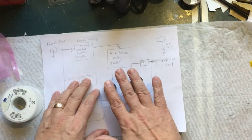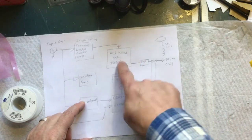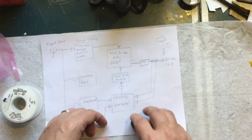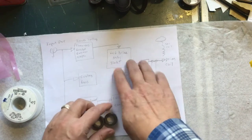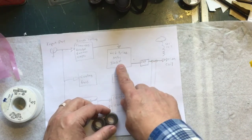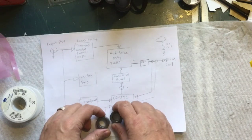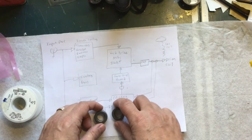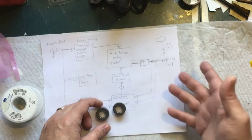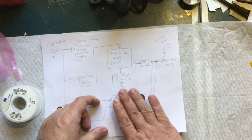I'm not an engineer — I did not design this — so I want to deviate as little as possible. I'm already deviating by using a different IGBT and different capacitors. I did contact Eastern Voltage and they told me what I'm going to use should work fine. Other than that I'm going to stick to the design as designed, because if I change 10 things and it doesn't work, I won't know which one is causing the problem.